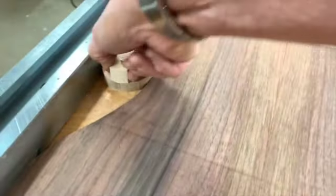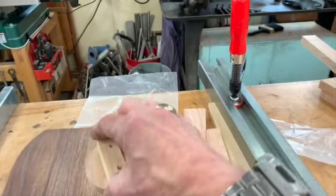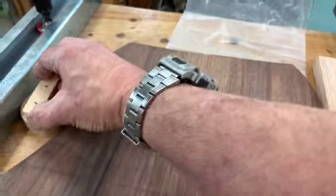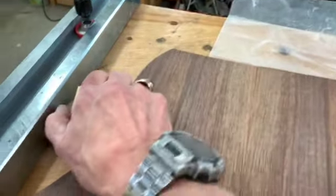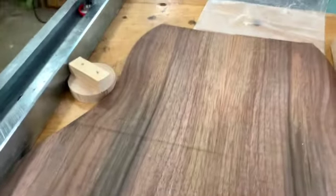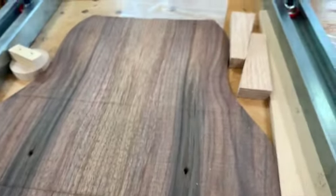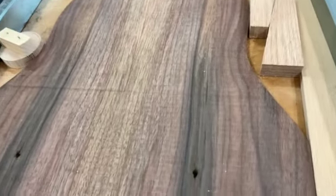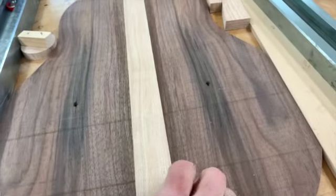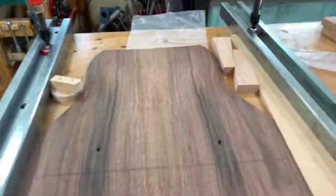And look at over here. If you make a circle that is not really a circle, this is one circle drill or cut, excuse me, from two different centers so that it's kind of eccentric. And you can just put that in there and tighten that up with your fingers. And that'll be plenty tight to put clamping pressure on that. And then the same technique, your wax paper and your bar over the top if you need to keep that pushed down. Just that simple.